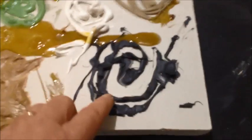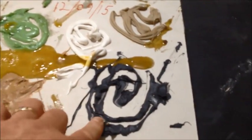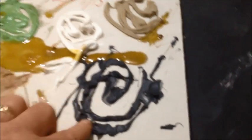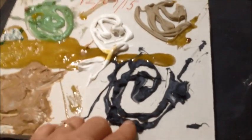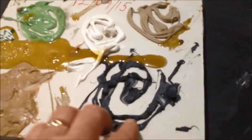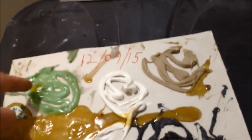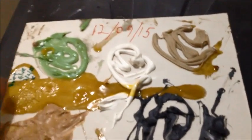Now, the other thing that we did was this Tremco sealant became highly recommended for doing the seams between where the walls come together. So that's what we ended up using, and I think this stuff is absolutely fantastic. And it seems to still hold its elasticity a lot like the green glue does. Maybe a bit firmer, but still very similar. So when I started testing, I thought, well, we'll throw that in there too, even though it's not intended to go between layers of drywall, it's more of a corner caulk. I thought the stuff was pretty cool, and it was cheap. I think it was like $6 a tube, compared to the green glue, which runs around $18 a tube, depending on where you get it. The Quiet Glue Pro, I think I got it for around, I want to say $12 a tube.